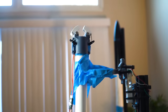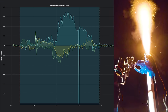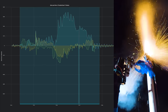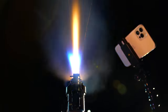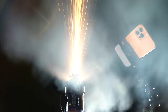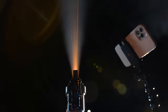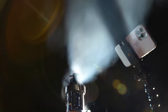Thing number two is a quick mention about side forces. On the F-15 motors, side forces were virtually zero. I had a load cell attached to the side of the mechanism, and on each firing plotted the amount of force that was off-axis or non-axial — almost zero. Absolutely within our ability to control that during flight. For the G8 APCP motor, those side forces are going to be a little bit bigger. The load cell didn't catch the side forces, but you can see the motor wiggling back and forth on the axis we're not recording. This is more confirmation that we should fire this motor one or two more times before we put it on a hopper or any type of flight vehicle.